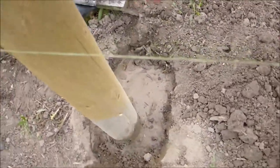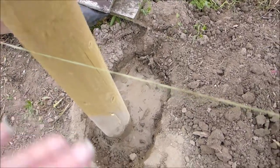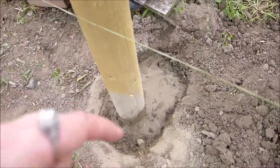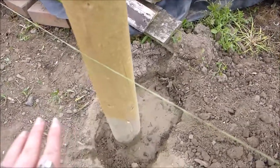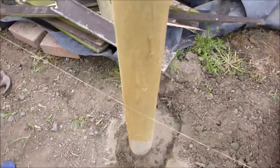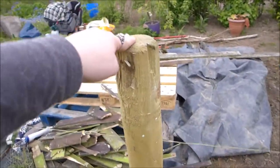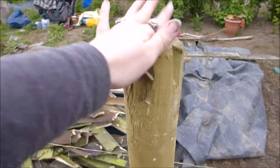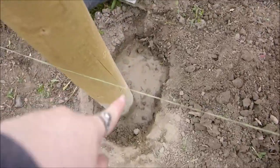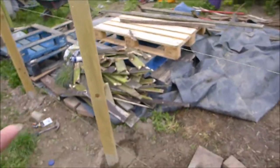This was a big hole — we backfilled it so that just underneath the surface there's actually all mud. We did it about an inch below the surface so we can fill this back with dirt and it doesn't look like a big fence post hole. This was done 10 minutes ago and it's solid — you can see it's still wet down here but that is a solid fence post at 10 minutes. That's what we use.